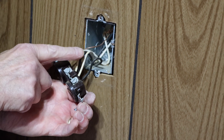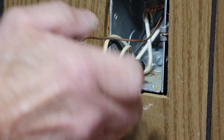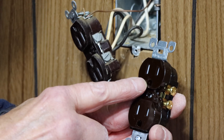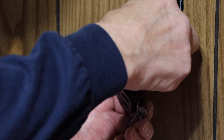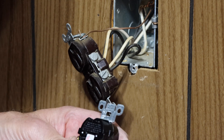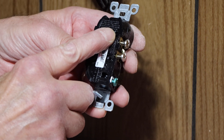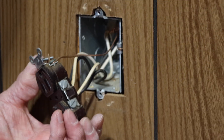As you can see there are four wires in the back here, so it's very important that you put these four wires on in the correct location. Remember, we're going to rotate this in the other direction so the ground is lower. Now, what they did here is they didn't use the screws to hold the wires in place — they chose to push them into the back of the switch through a small hole. I never recommend using that method because it will definitely create a short, maybe not today or tomorrow, but someday down the road you're going to have a problem.